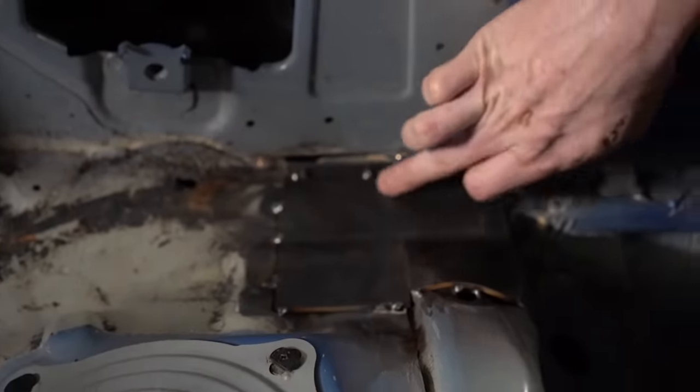You can see along this plane, my points are in line, and then you can see how they taper off to the left because this is the driver's side half lateral. And from this side, you can see how the tube needs to go up, down, down some more, and finishing off there. So since I want my tube to have three bends, I'm just simply going to click on the bend command. I'm going to input three bends. I'm going to start from the center of my bend on the main hoop and literally just connect the dots.